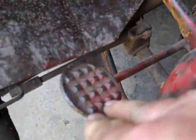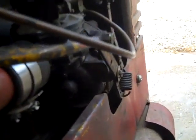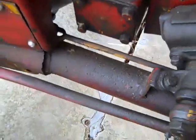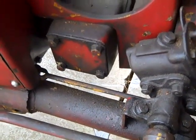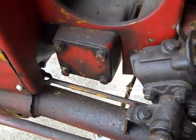How you identify it: it's got this transportation pedal, and this actually overrides the governor. So when you're going down the road you can override the governor and get about 3, 4, maybe 5 miles an hour more out of the tractor. Used with a PTO shaft — which I have here — it would be used for like a sickle bar mowing along the highway. That's what this tractor was originally designed to do: highway work back in the 40s.